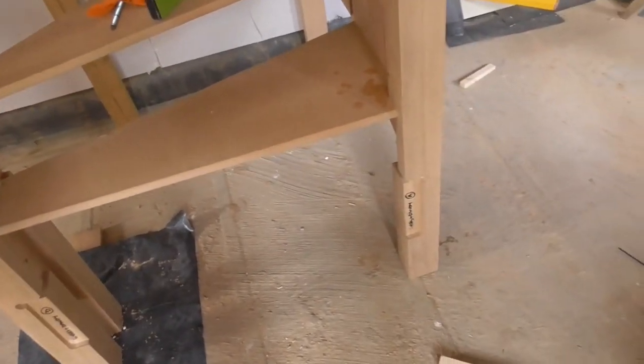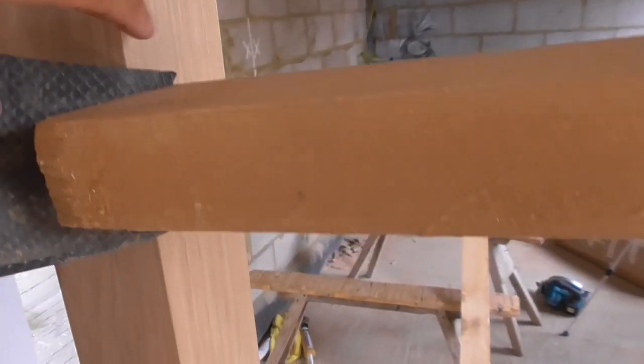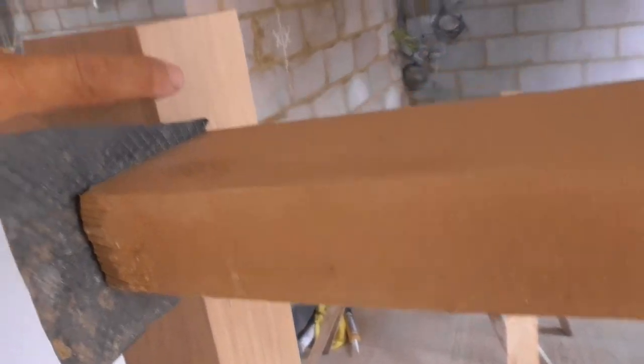That really is the back of it broken now. All I've got to do is put the bullnose in and then put all these risers on and pack it off the wall. This wall hasn't been skimmed - we know that - but I'm going to pack this off the wall a couple of mil. The plasterers are absolutely excellent and they'll make a lovely job around that. Just put a little wedge down there - a double layer of DPC to protect the oak post. I'll leave it overnight and that glue will hold it nice and tight.